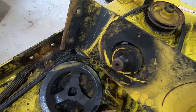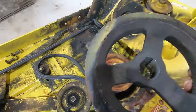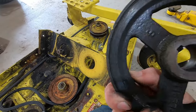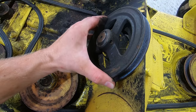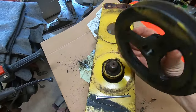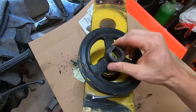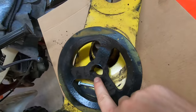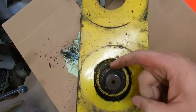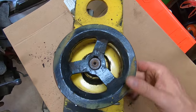Just as I feared, this does not look good. The shaft is quite scratched up. Looks like it sheared the keyway. Maybe saveable. Here's this pulley — we saw earlier quite a bit of play, but most of the damage happened right here. The keyway, the key that was in the keyway — I don't know what happened, but this thing loosened up somehow and started moving around.